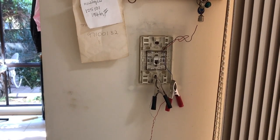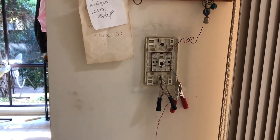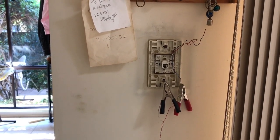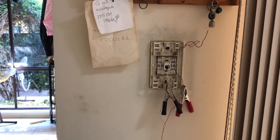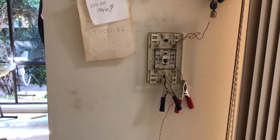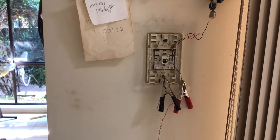So what I've discovered is there's 48–50 volts sitting on this line still. The guys, when they did the installation, told her just to plug into her phone socket. But you need to disconnect the Telstra lead-in cable because that's going to play havoc with it — there's 50 volts coming in.